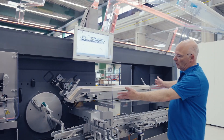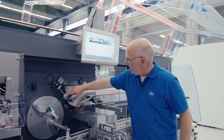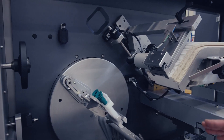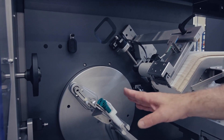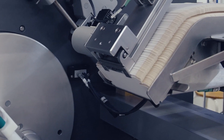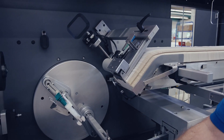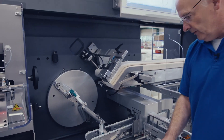The carton comes from a long magazine. It is separated here with a patented mechanism to singulate the first box from the magazine content. The carton wheel with grippers picks this carton, opens it, forms it, and places it between an upper and lower carton transportation belt.